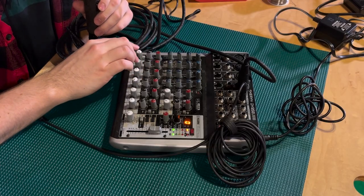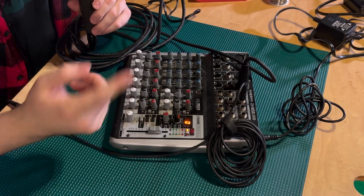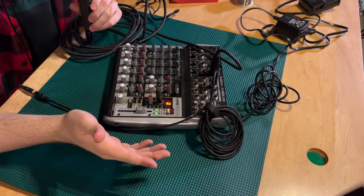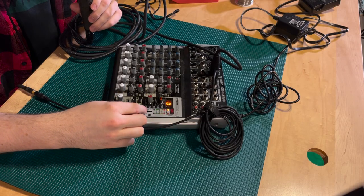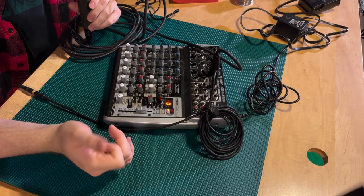This one doesn't seem to be in awful shape. I was just told that it wasn't working well. It seems like the first two channels are working just fine. Channel 4 is also pretty good. Channel 3 was super quiet. And I still need to test if anything comes through on channels 5 through 12. What I'm seeing mostly is if I kind of move this, it gives that scratchy thing. One of my headphones cuts out. Some of the knobs, if I turn, they get scratchy. So probably what it is, is I just need to clean it up and give it some grease.